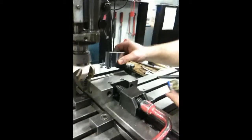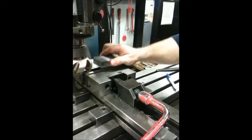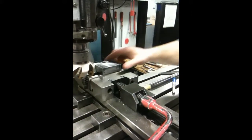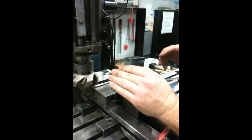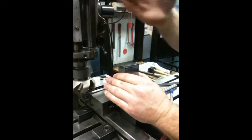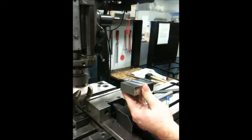When we put surface two down in the vise, we want it to be on top of parallels. Surface four, we will sit on top of parallels in the vise with no pin. Surface five, there's two different ways to do surface five. We can stand it up, put a square up against it, and fly cut the top, which is usually the preferred method — it all depends on the height of the block. When it gets too high, it's not rigid enough. Another way is to set it down inside the vise and take an end mill and do the ends.